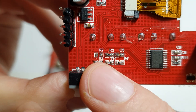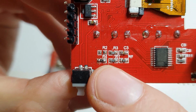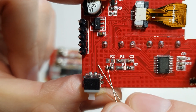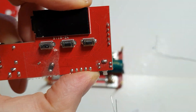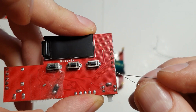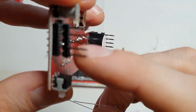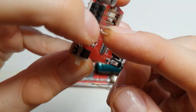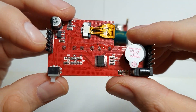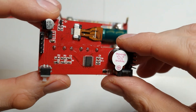So you remove R4 and simply solder a resistor on the two contact pads — a quarter-watt or smaller. Cut the legs, make an S, solder one end on this pad and the other on this pad. I had an SMD resistor so I swapped it out with that. Then verify it's in place correctly: flip the board and check that from pin 4 to the resistor — or pin 19 — you have 470 or whatever ohms you put in. 500 or 560 is fine, just stay around that value.